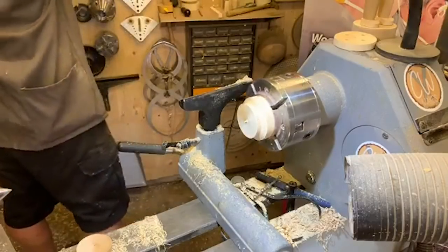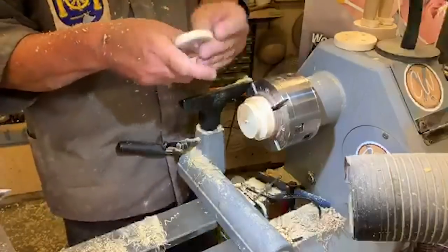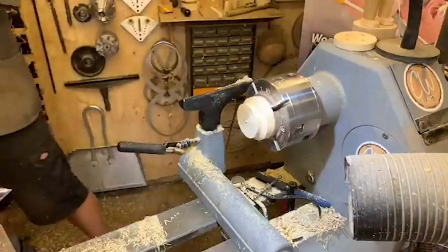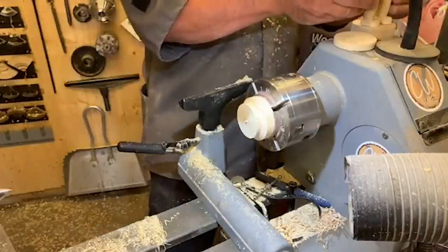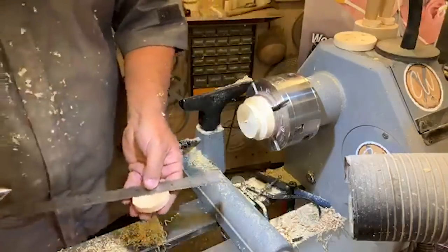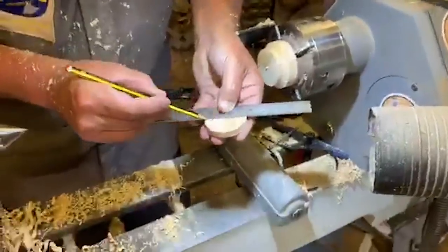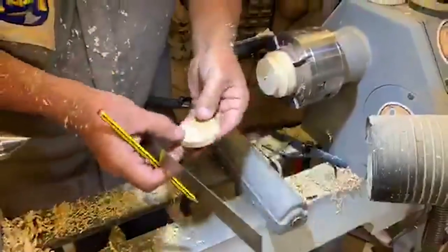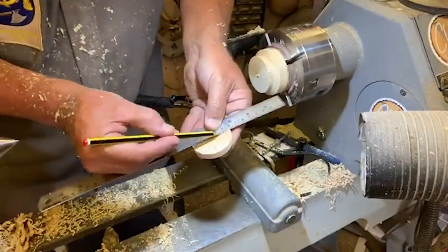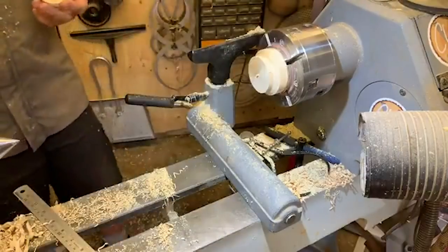Right, now we're making proper progress. Let's pick the cleanest one. So there's my base — once again a line across there. I'm not overly fussy but I'll try to get as right-angled as I can to that first line, because we need four holes. It doesn't have to be exact. We're going to use our dividers again. I think we went to 34mm — let me just double check. That's it, we went to 34 to round things up. So 34, and I need a bit of scrap wood behind this because I'm going to drill right through.